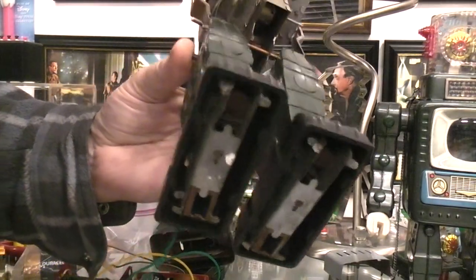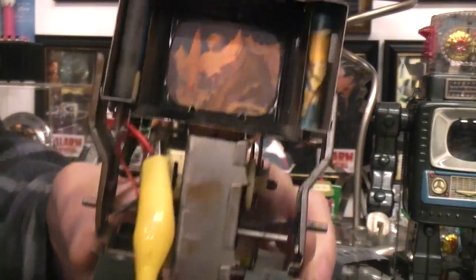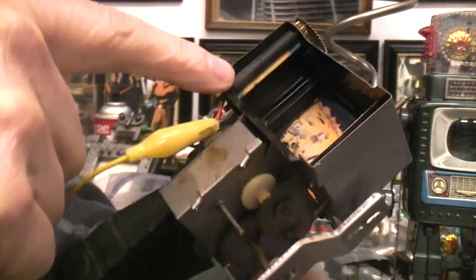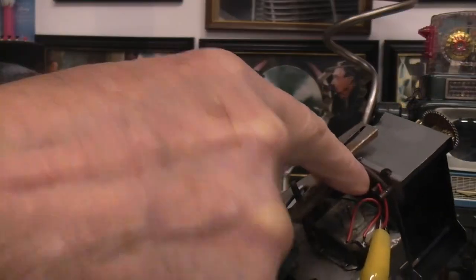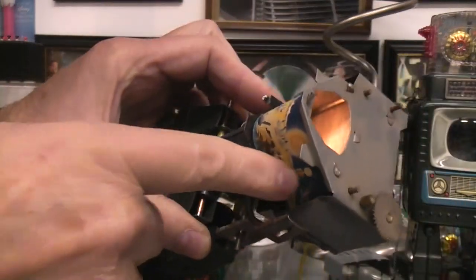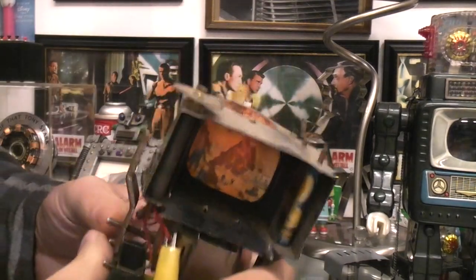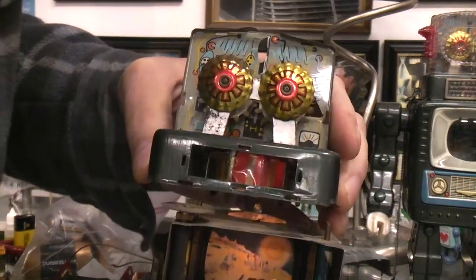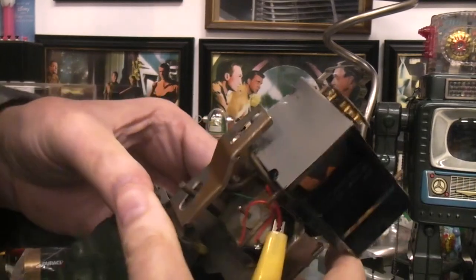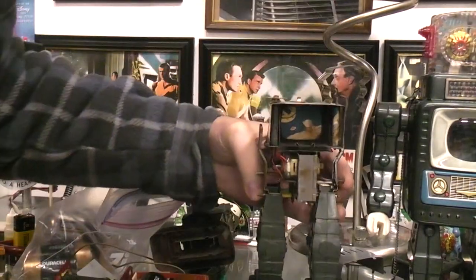I've got more of a place to clip onto here — here we go. You can see these pictures how they move around, being driven by the gears that run these rollers. They pinch the paper — in fact they're spring loaded; there's a spring right here that pulls the front roller tight against the driven one to move the paper. It loops all the way around and comes back, and as I said, that same light would shine up into the robot's mouth to illuminate the color wheel, which was driven by that other flex drive. Really a cool mechanism. Until the color wheel transparencies come loose, these things usually continue to work quite well.